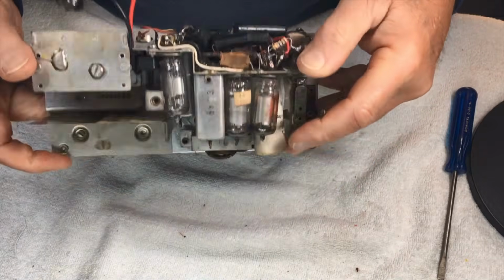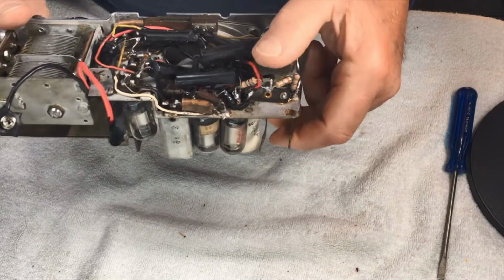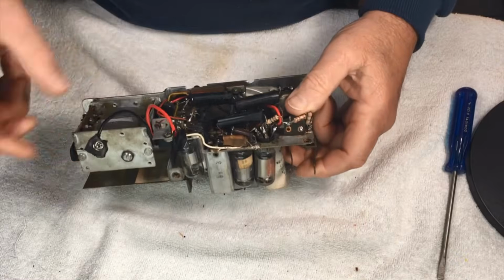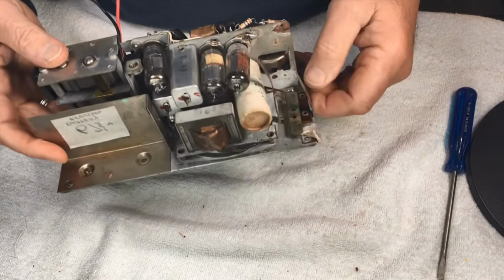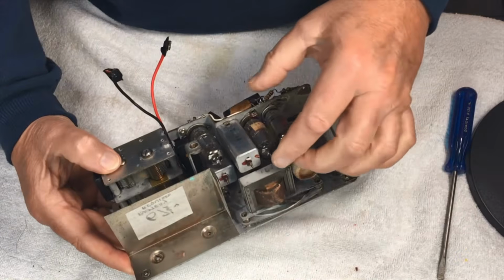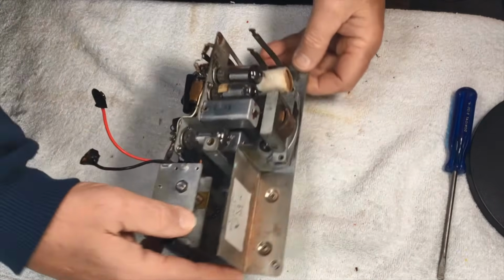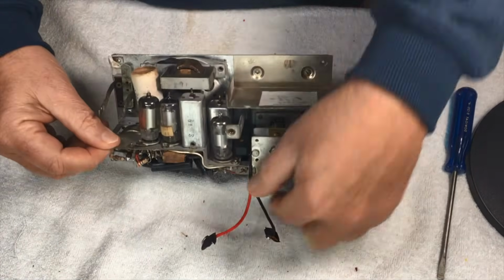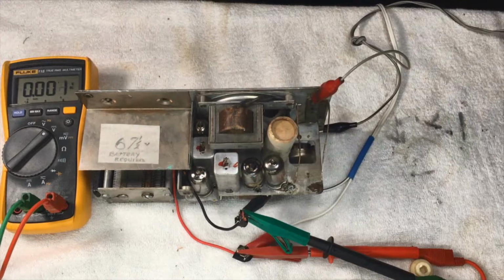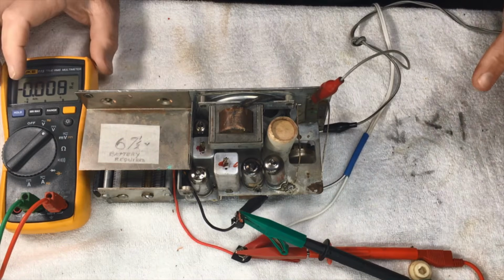Well, I don't know whether to start this thing up. I guess we will. We'll put 67 volts on here, and we'll put 1.5 on our heaters and see if we get any sound out of it before we take the tubes out or before we do anything with it. So let's do that. Sit him here, and you never know, he might do something. Let's try it. Righto, we've got our multimeter on our battery line, which should come up to 67.